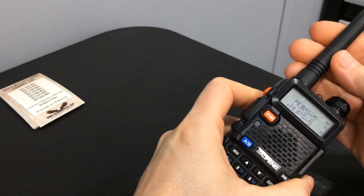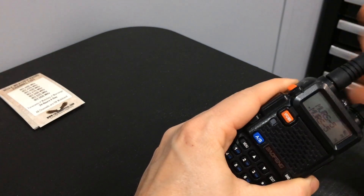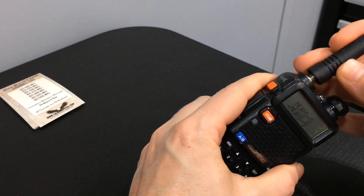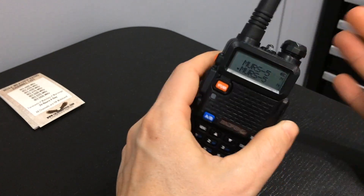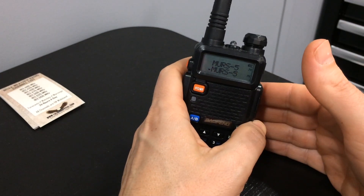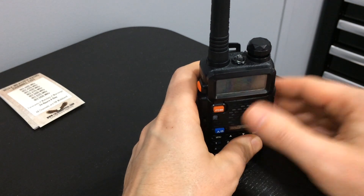There are a couple of things on that. If I'm working in a car, the car is going to block my transmission. But if I take this off and hook up a tuned mobile antenna, I could very easily get five to seven miles between a portable and a portable in a car using an external antenna — they're also a more efficient radiating antenna. So think about a half mile in an urban area with buildings, obstructions, and heavy foliage, up to pushing five miles with clear line of sight. Don't ever expect your 35 miles.